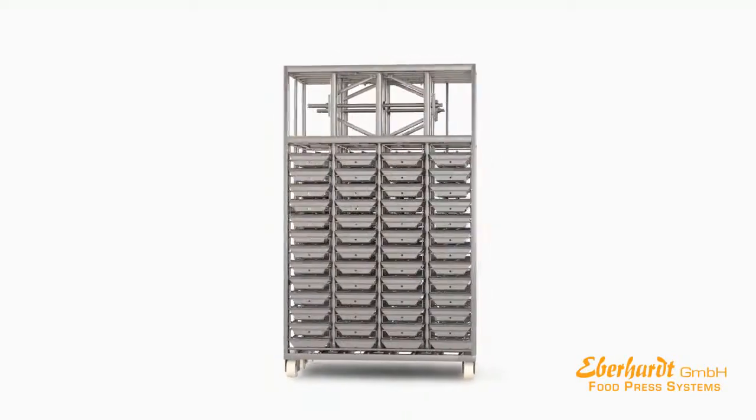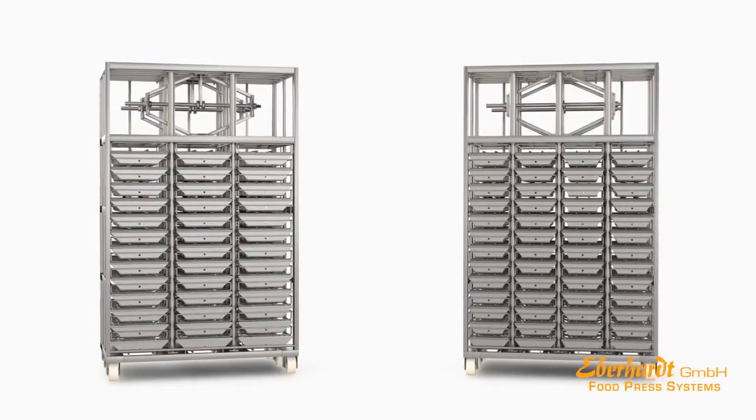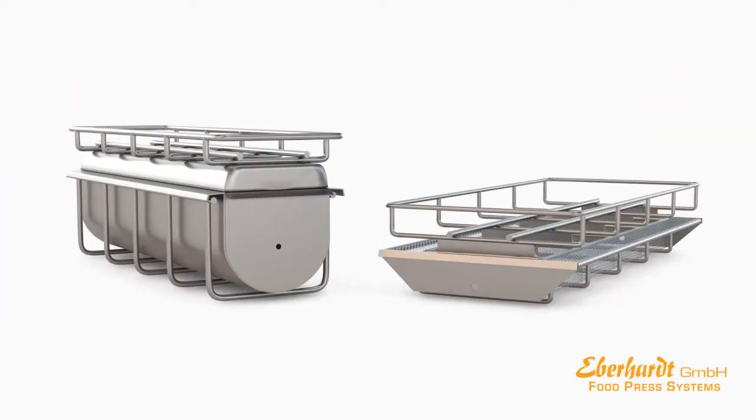We will provide you with a press system of either 3 or 4 compartments. The number of compartments varies according to the width of the product. Depending on the size of your slicer, we supply you with press systems for products of different length, 600 mm, 800 mm, or 960 mm.